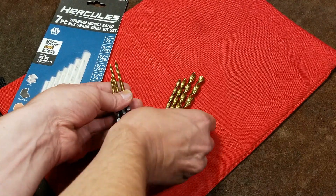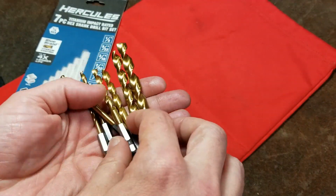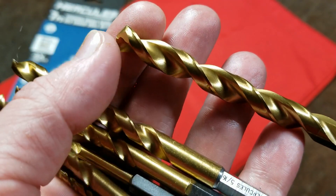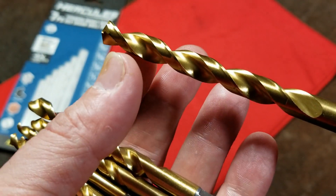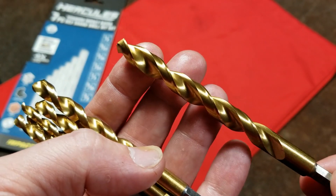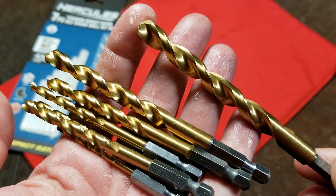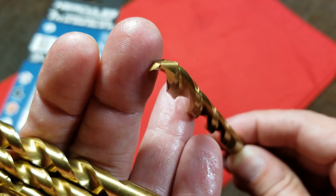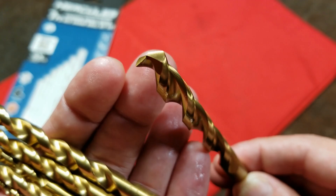If we take a look at these drill bits, what I thought was interesting is how they decided to build these. There are two distinctions: one, they have a progressive flute, and on the largest one we can see how thin the flute is right at the top where it's much thicker at the bottom. This gives it much more clearance, so when you're drilling soft materials such as wood or plastics it will really move fast. This is the same thing that the DeWalt pilot points use, but these instead use a split tip — an extra little grind giving you two little cutting edges right at the tip to help prevent walking.